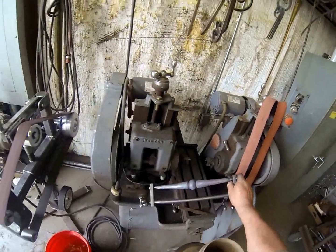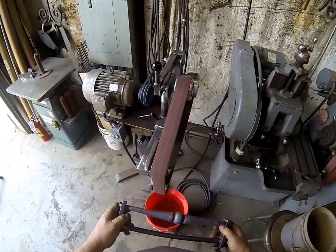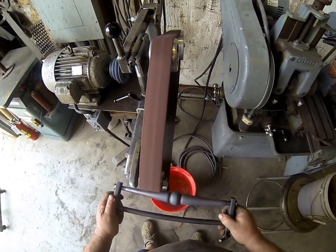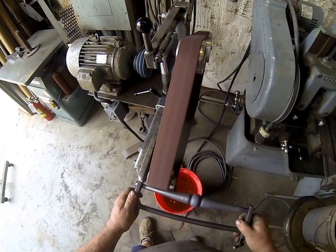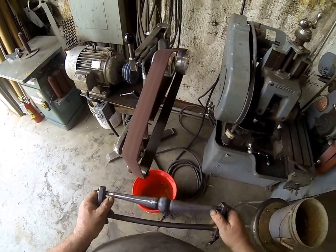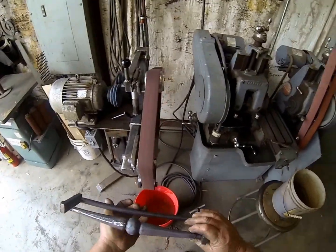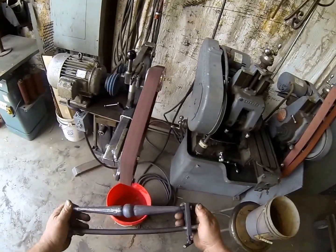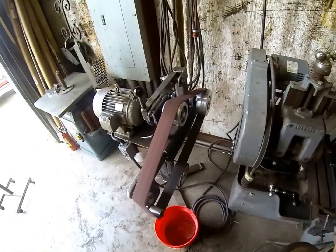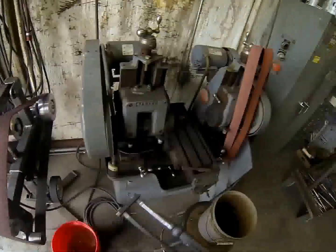There's a little piece we're making right now — a little fixture I made to hold pickets so the center piece of the picket can be trued up to make them nice and round and smooth, like the customer wants. We don't have a lathe yet, so this is my kind of homemade lathe. You can see how the slack in the belt lets me push in a little bit and contour to a curved surface.